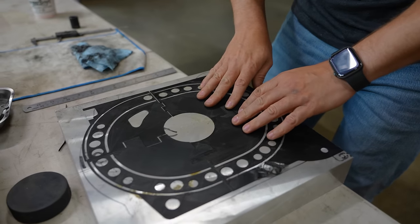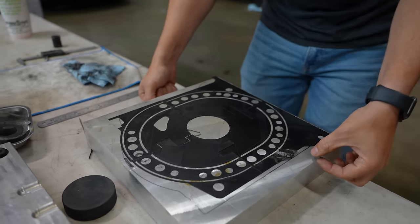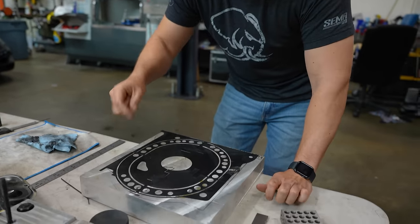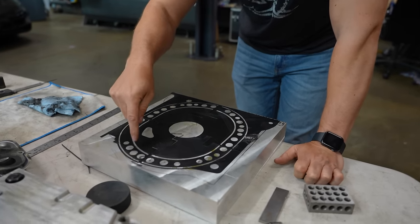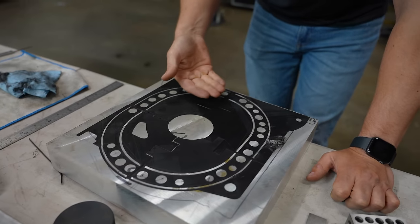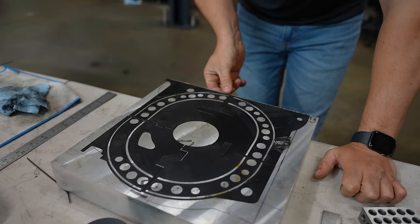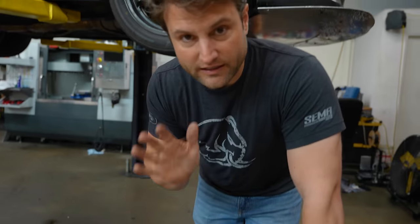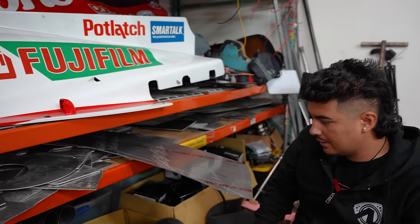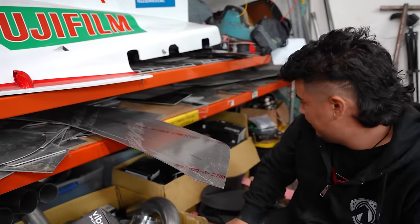So what we are going to do first is take a thin plate of aluminum, put it in the CNC machine, hold it in the corners, and half of that thickness, we're gonna go ahead and take a small mill bit and go through and basically create this shadow, a fraction of an inch thick, to see if everything lines up. This is the thickest stuff I got.